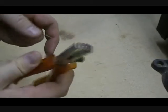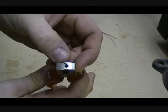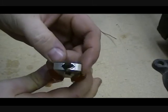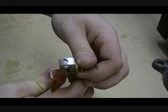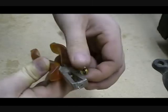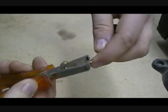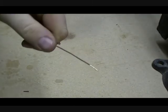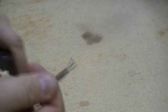Now there's a different kind out there — this guy right here, a pretty old little tool. What you have here is a little two V-grooves that come together and bite the wire. You go back and forth with the set screw until you think you have about the right size, lock it in with this piece right back here, put the wire in there, and pull — and there you have it, one more stripped wire.